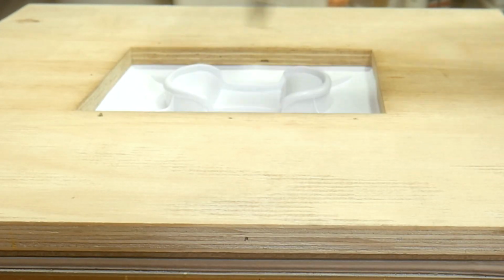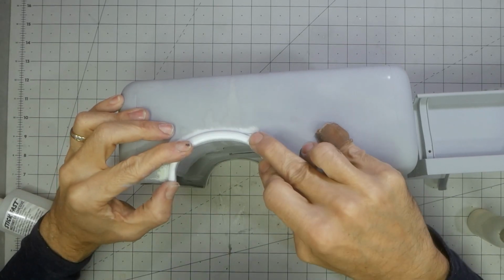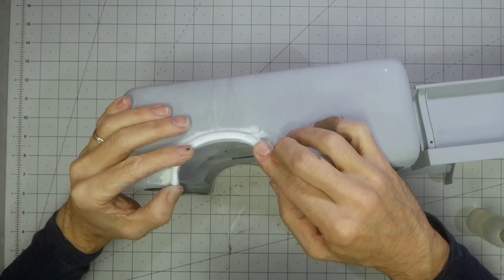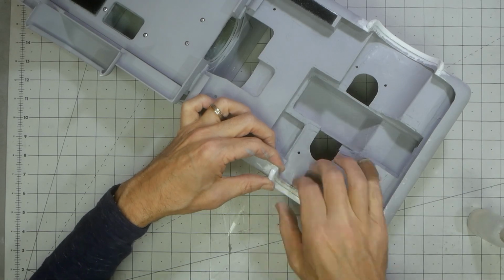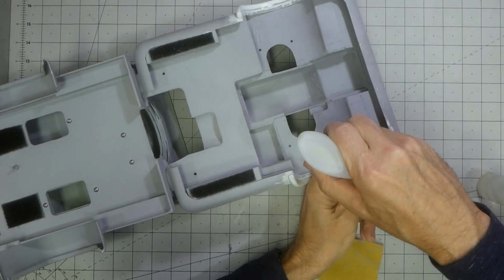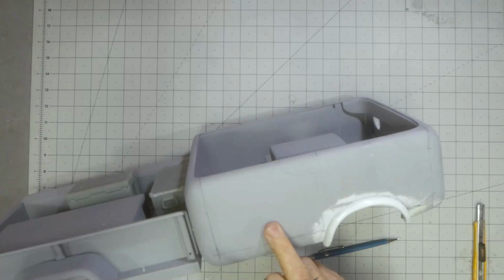I had almost forgotten about making fender flares for the front. They're not very big, but pretty crucial to the look. I was able to design these in Fusion 360 and print them in resin. This piece was mounted to some MDF to give it some structural support. All of this then gets vacuum formed with styrene before attaching to the body.